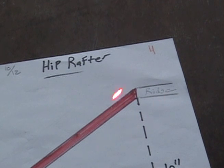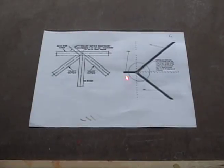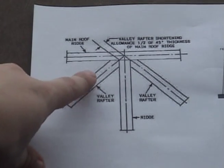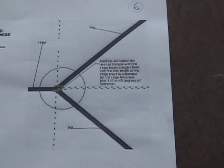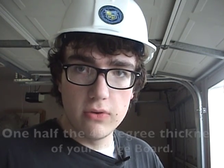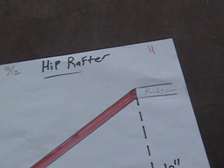Now let's talk about how to mark your first plumb line. The first plumb line goes against the ridge board, but there are two types for hip and valley rafters. There's the type in which the ridges or common rafters make a T-shape, and you will have to cut the rafter into a point, also known as a double cheek cut. The other is when it's just the ridge board, and you cut the rafter into something called a single cheek cut. You have to shorten your rafter by one-half the 45-degree thickness of your ridge board, which is usually one and one-sixteenth inches, to ensure the rafter will fit up against the ridge.